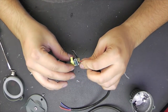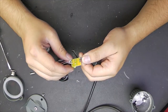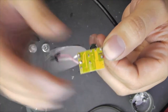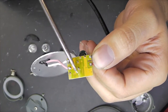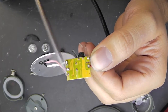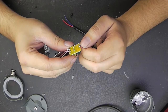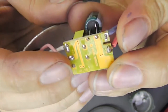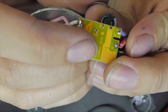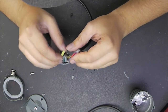It is completely isolated, the mains from the secondary. The creepage distance isn't that great. You can see it right here. The primary winding is those two pins, and there isn't that much space to the secondary. But well, it should work. Oh, and it is made by, where are you? There. I hope you can see it. It is made by Dark Energy. Ooh, creepy.